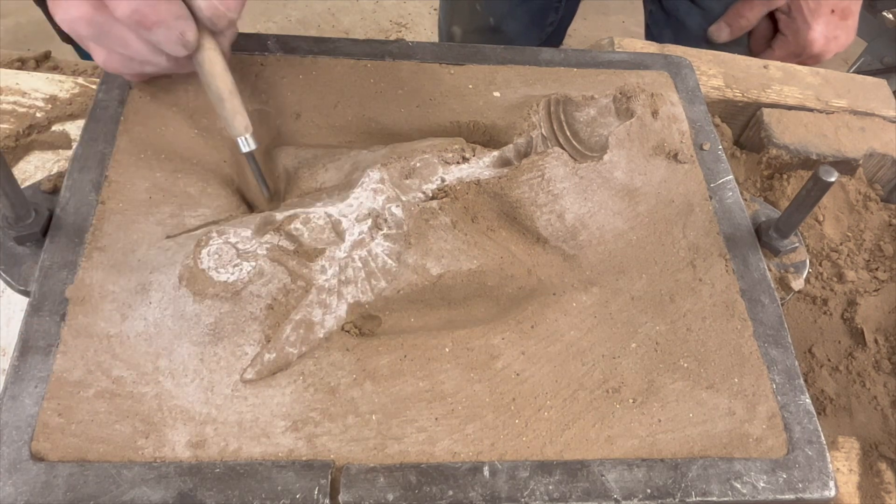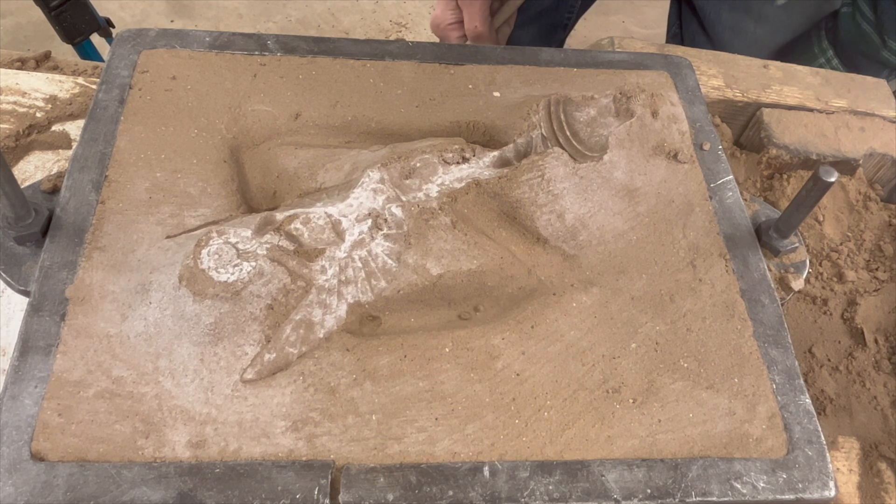A little touch-up right where the gating meets the actual mold — don't want any ridges in there — then I blow it all out and put it together. You've got your furnace up and running and your scrap in there. How do you know when it's hot enough to pour? What I've learned over the years is: once your metal goes liquid, you'll get a little stir. Once it goes liquid I normally wait about five minutes or a few more — that gets you around 1,300°F. It melts somewhere around 1,250–1,280°F. For today, the goddess has those super-thin wings, which is going to require more heat.